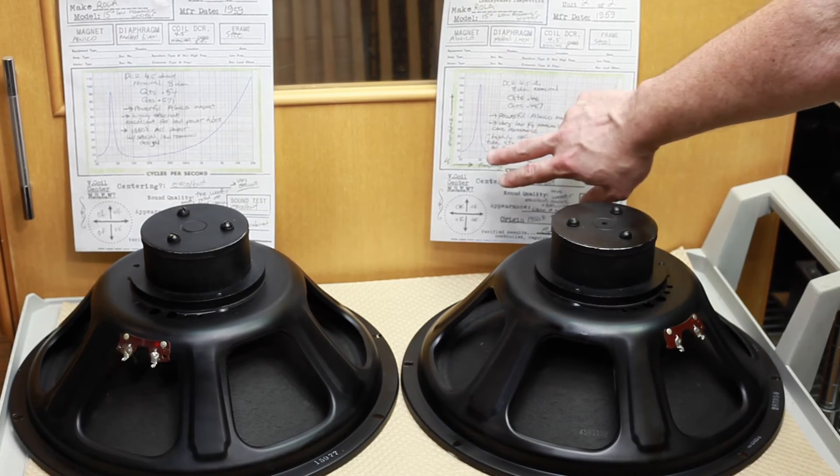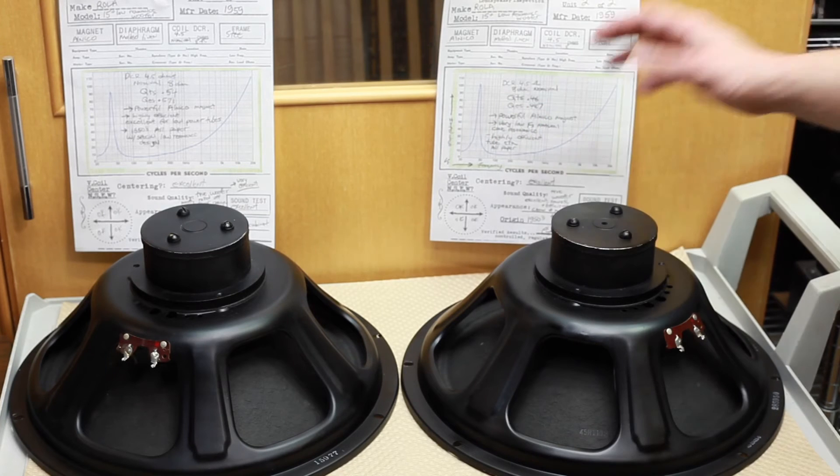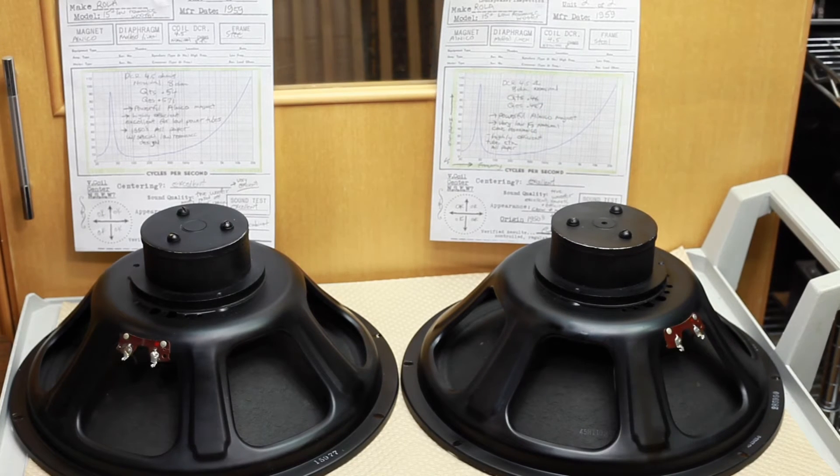You can notice that they have a high peak and really powerful magnets. So with the relatively low Q, they're going to have a nice strong resonance point. Free air on these two, the resonant frequency was about 40 cycles — which is also very, very low for a vintage speaker. Probably the only thing I have around like it.